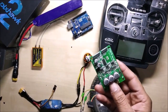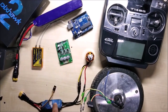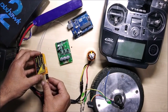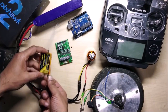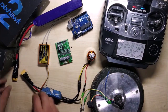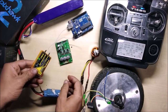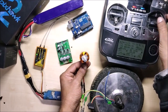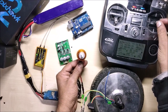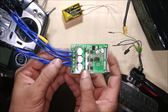This is a 36 volt, 500 watt BLDC hall sensor reader controller. This is not the same as an RC model ESC. When we use an RC model ESC, we connect it with a receiver which is paired with a transmitter and power up the whole system. The model works fine, but when we use the 36 volt ESC, things are different.